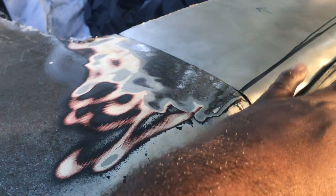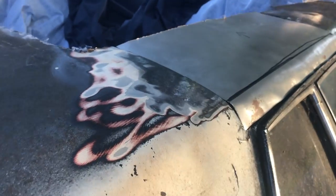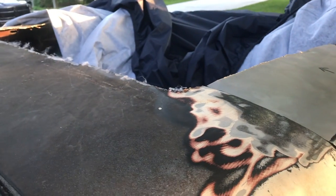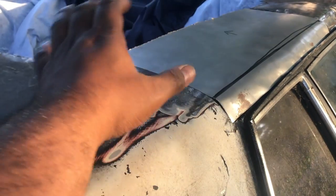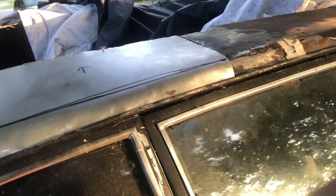The biggest part is grinding down the welds and putting filler on both sides. I'm thinking about waiting to fill the welds and doing the fiberglass after I'm done with the panoramic roof bracket — but I might just go ahead and knock out both sides, then work on the bracket, and after that I can work on the front of the car, patch anything around the windshield.